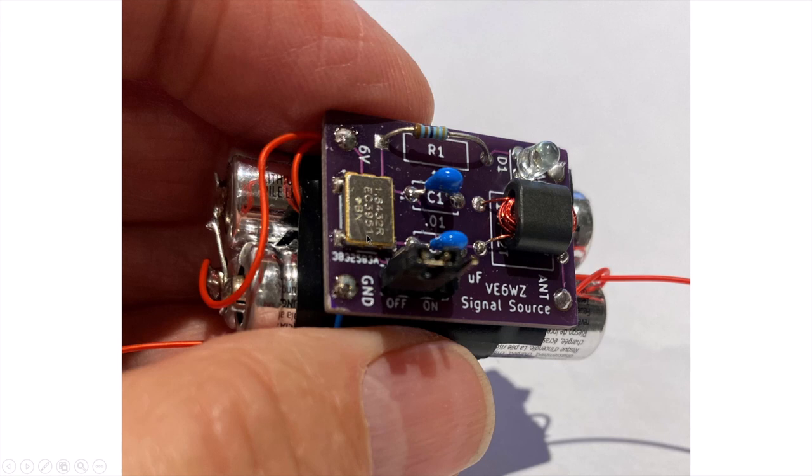But I honestly think if you wanted to, you could probably get by with some flux and tinning the pads and using a soldering iron. You could probably get it on there. You'll also notice in the photo here, I've got the circuit board mounted together with the three AAA lithium batteries. What I discovered was lithium batteries not only are really good in terms of their service time, but they're also the lightest batteries you can get. And so that's why I decided to use those units.